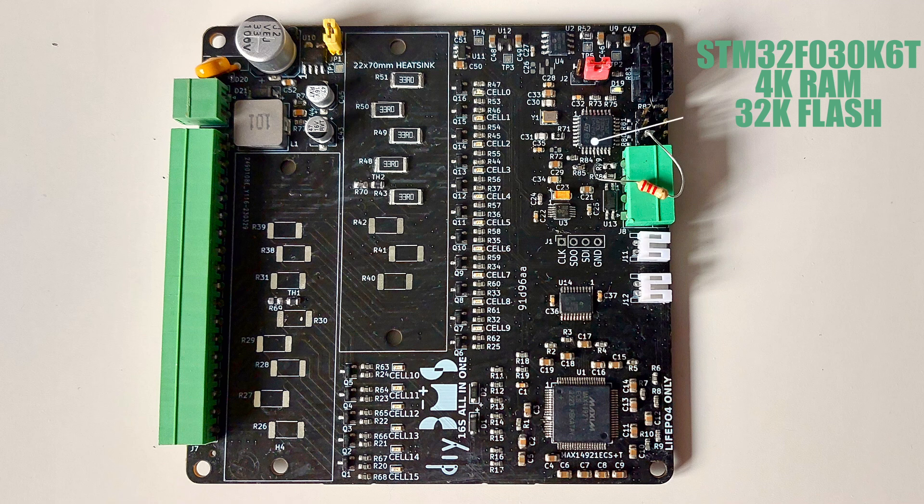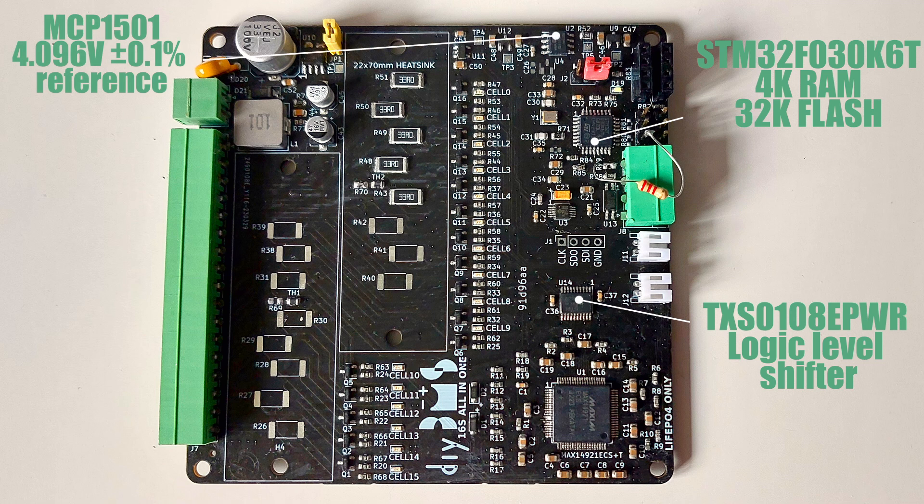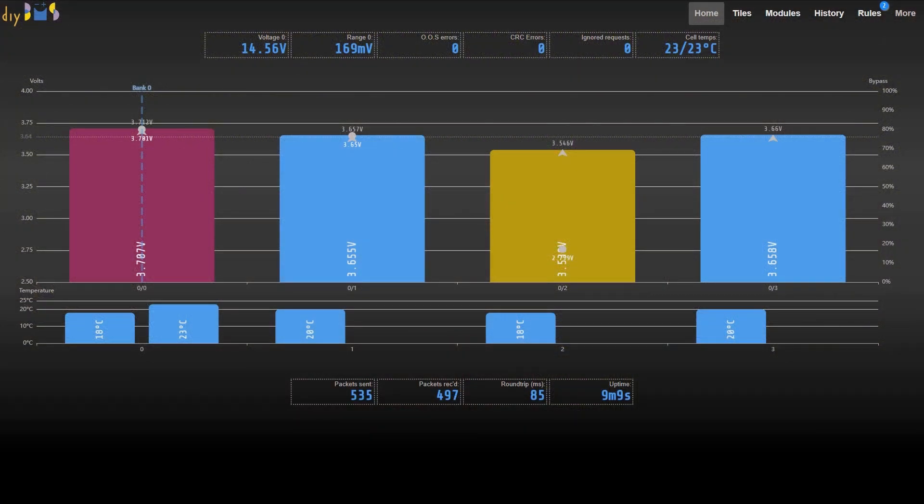Using software control from the microcontroller, the analogue front end is instructed to present each of the cell voltages to the 14-bit analogue-to-digital converter. The microcontroller then uses the external ADC to take multiple readings of each cell — known as oversampling — to obtain a higher resolution. Finally, all that information is sent back to the controller. Because all the cell voltage calculation is handled in a single board, the communication requests don't have to hop through multiple modules, which improves the speed of the replies to the controller. In this prototype, it takes less than 100 milliseconds to sample 16 cells.